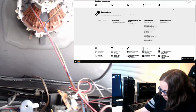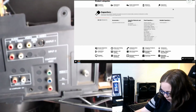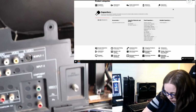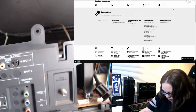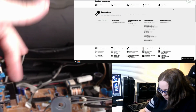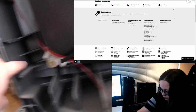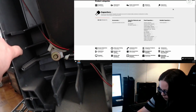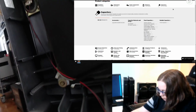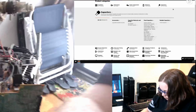The better way to say it is, a lot of these RGB TV mods I've seen, you end up modding the back case of the TV. So you have to be very careful when you put it back together. There's a lot of long wires. Whereas if we're just going from here to here, that's going to be a short wire run and you don't even have to worry. In fact, there were a few TVs where I asked Jose to put the SCART connector here on the side, just for that exact reason, so that you could leave the back off and not have to worry.